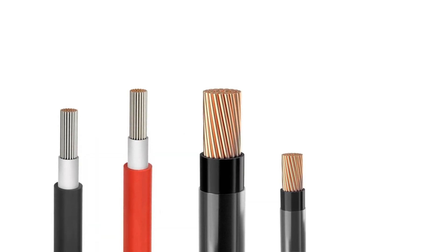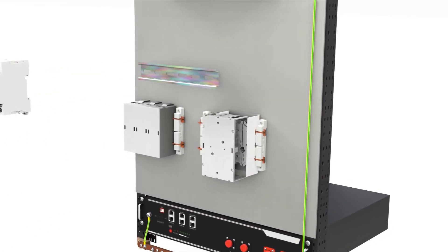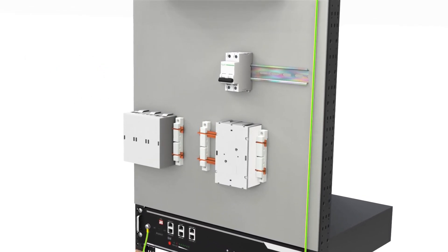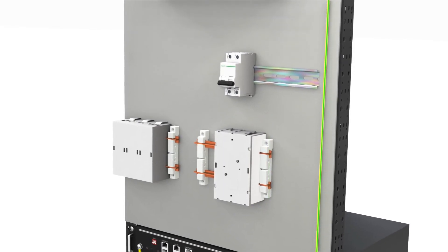When connecting the wires, ensure you're using the appropriate wire size for your inverter model. Consult the manual for specific wire size recommendations for each model. First, mount the busbars and DC switch. Sometimes there are direct links to the battery, which is why this busbar has extra room for more connections if needed.